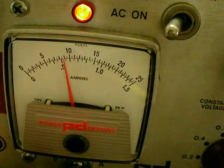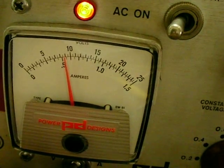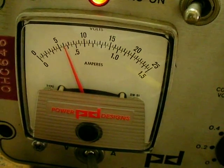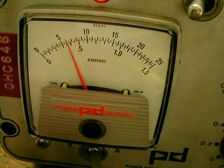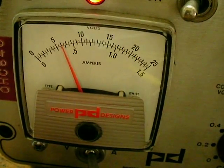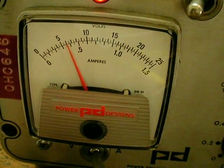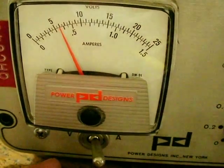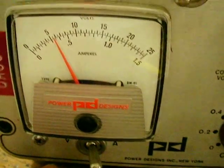There's no noticeable difference, so I'll put it back to 9 volts. Let's check the ampere consumption — it's about 375 milliampere for this. So it's actually great. It's a great result for this circuit.